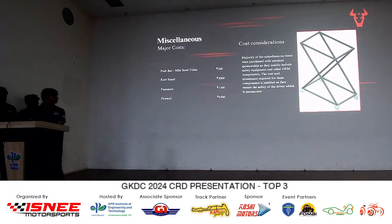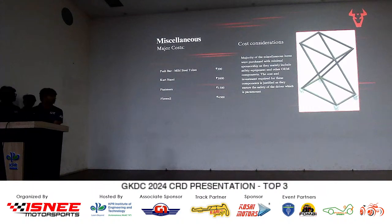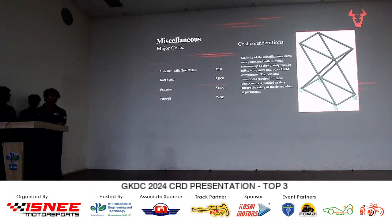These have mostly been sponsored, and we've used a lot of OEM components here. Our firewall, which is 4,500 rupees, is slightly more than what we wanted to spend. But keeping safety in mind, we have used a composite style firewall, with a layer of 1 mm aluminium, 1 mm thickness FR4, which is fire retardant 4, and then another layer of 1 mm thickness aluminium. So that increases the cost, but we also increase the safety quite a lot. Thank you.